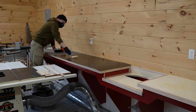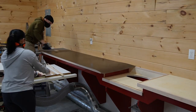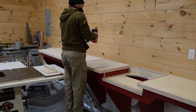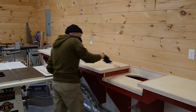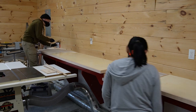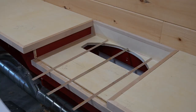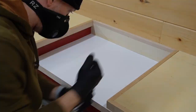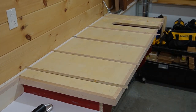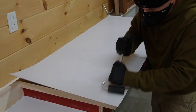If you've never worked with contact cement before, please read the label and be careful — this stuff is highly flammable and the vapors are nasty. We waited for a warm day so we could have the garage windows and doors wide open with three fans going to push air outside, and we wore carbon filters in our RZ masks. Once the pieces were tacky we spread a few spacer strips across the surface, positioned the laminate, then removed one spacer at a time and used a J roller to apply even pressure across the whole surface. This creates an immediate and permanent bond, and you can continue working with the material right away.